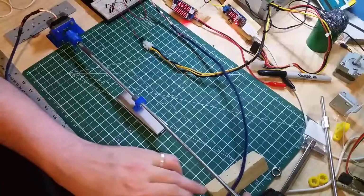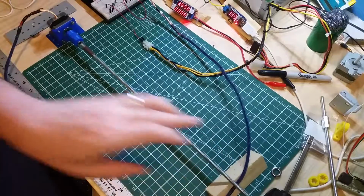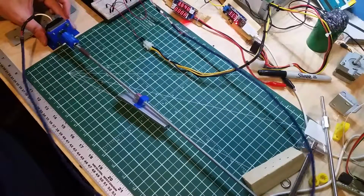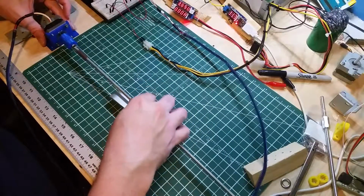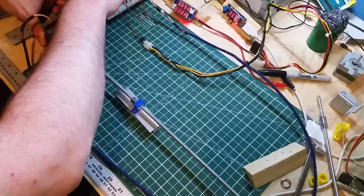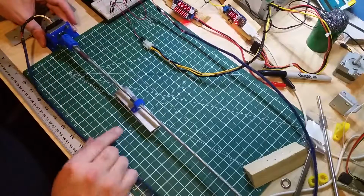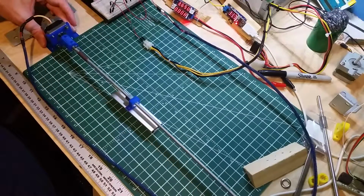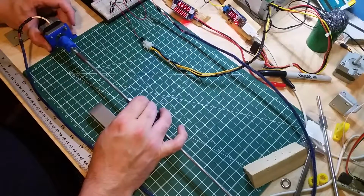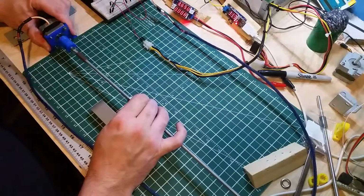This, if I had something to hold this over here, besides just that little washer type thing, you would see, in theory, it would run just as a sled. Let me just quickly do this. If I had that set up right, it would just run that way anyways. That's why you'll see some printers, they don't constrain the far end. They just let the far end move, and you just hang on to this part here. So you'd mount the motor. But this is where you get your Z wobble from on some printers.